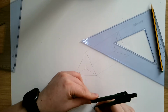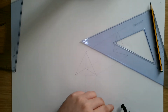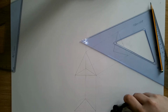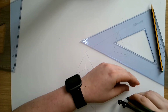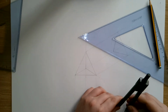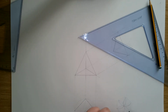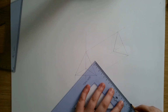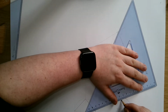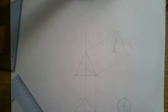If you remember from your circle theory, it's one of the things I get first years to do. They do their circle art. And when they're doing their circle art, they draw a circle like this. They keep the radius the same. And they're able to do their flowers like that. Don't know how much you might remember this. But basically what it is when you do that all the way around your circle, you get a pretty flower pattern we're not too concerned by. And more importantly, you get a hexagon. So if we were to join up where those edges all met, like that, you get a hexagon like that. So that's what we're looking for. So that's the theory you need to draw this part in. And I hope you get the drift from that.